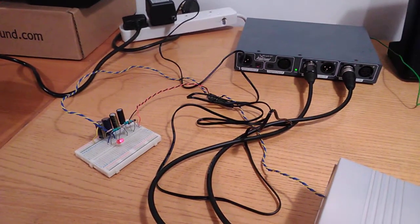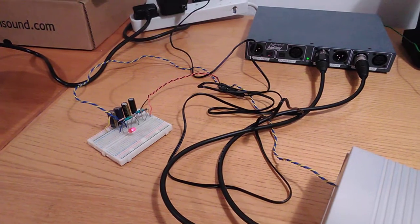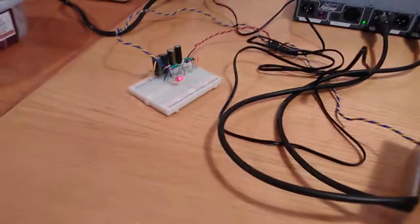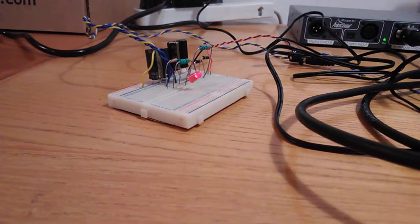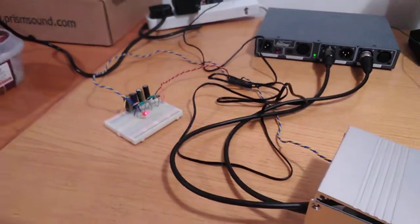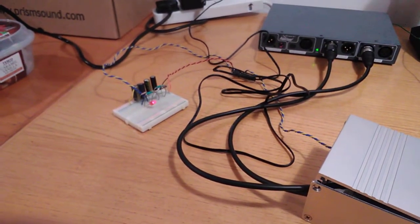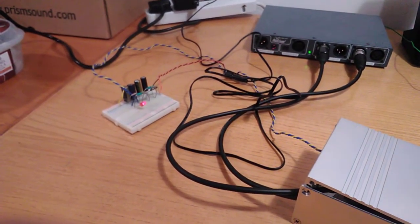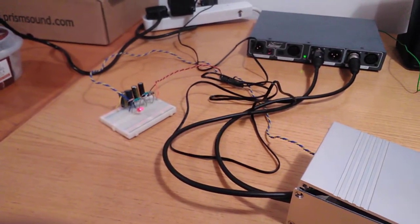And I wanted to see if I could build a phono preamplifier with modern amplifier ICs that could handle an unregulated power supply, which is a rather dubious proposition for any amplifier circuit that needs to have 60 decibels or 1000 times gain or more at 50 Hertz, the main frequency in this country.